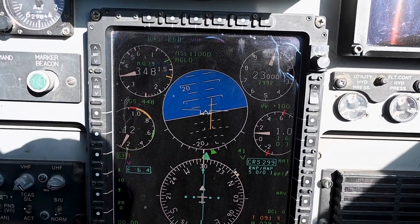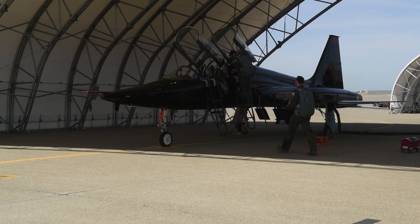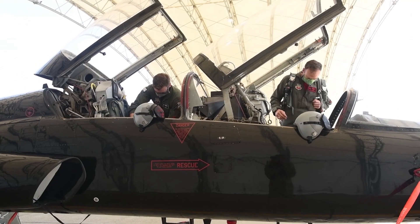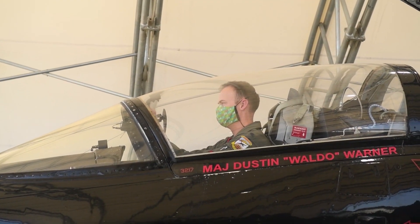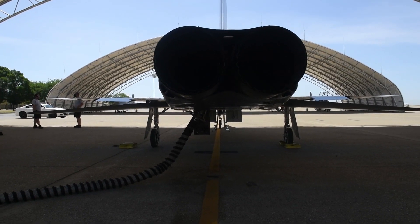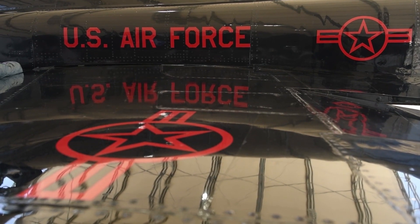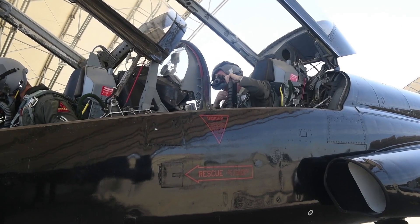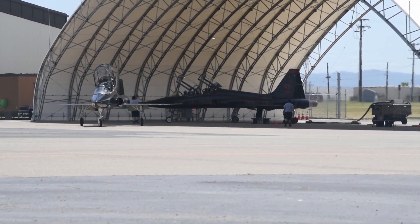Various design decisions were taken and features were incorporated to simplify the T-38 and make it as easy to maintain as possible. To avoid removing the vertical fin while changing an engine, the fin was attached directly to the keel structure between the engines. Instead, the horizontal stabiliser along with the entire aft shell of the fuselage surrounding the engines could be removed by undoing several fasteners and disconnecting two pushrods connecting the pilot's control stick to the horizontal stabiliser's hydraulic actuators. To avoid breaking and reconnecting multiple hydraulic lines during an engine swap, designers mounted the hydraulic pump and other accessory drives on the fuselage, joined to the engine by a short drive shaft.